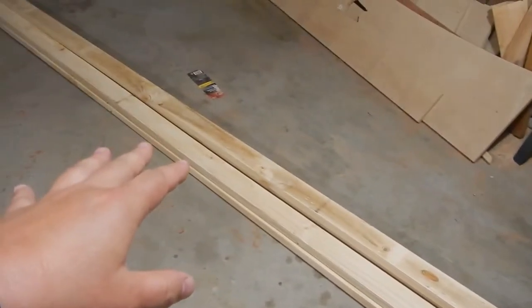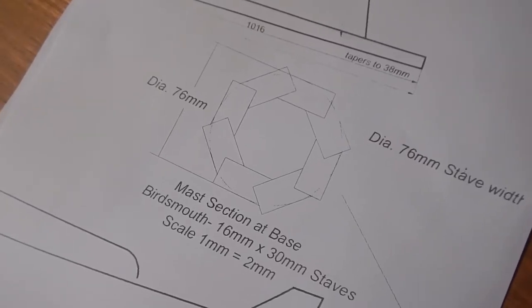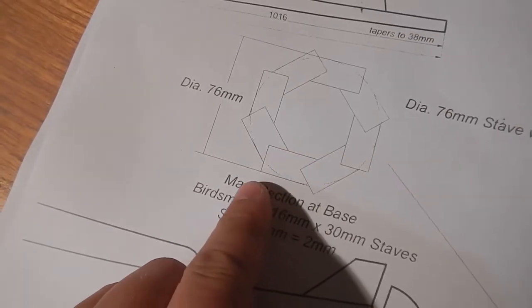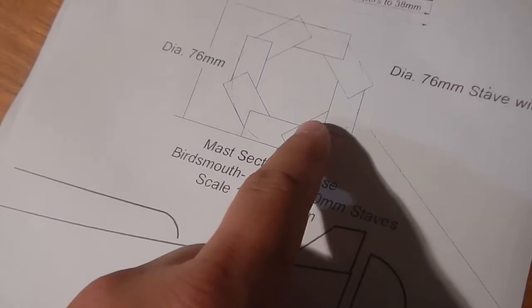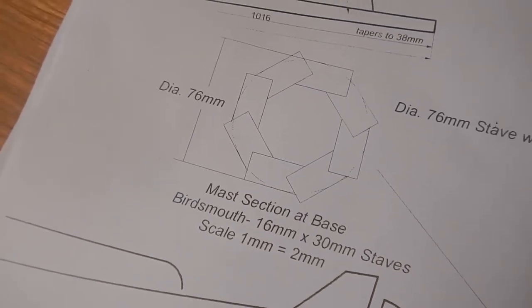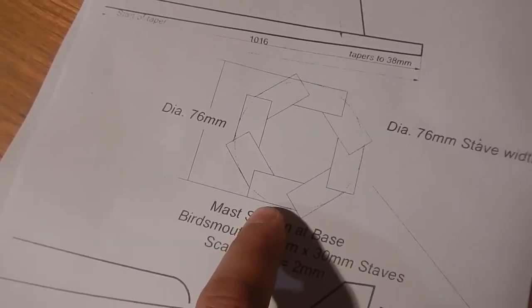I can't really get an aluminium tube anymore because that would involve lots of complicated messing around and everything's kind of locked down here, so building a wooden mast it is. I have to cut it to the right dimensions. This is a cross-section of the mast before it gets shaped to its final round form, and each of these eight staves is 16 millimeters wide and 30 millimeters tall, with a V-shaped groove cut in the end so it tessellates in a round direction.